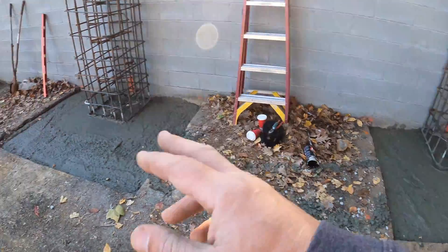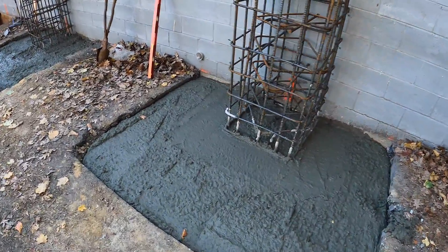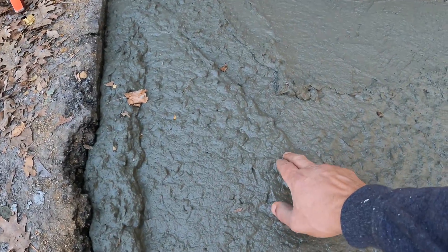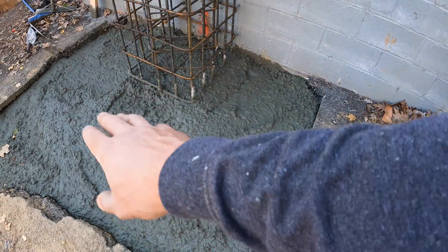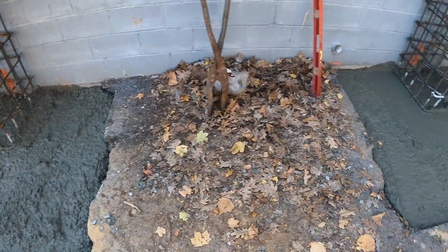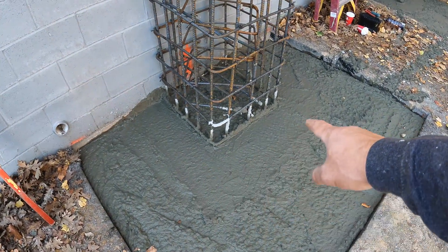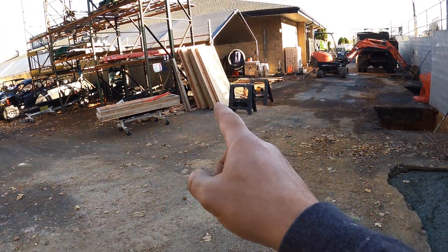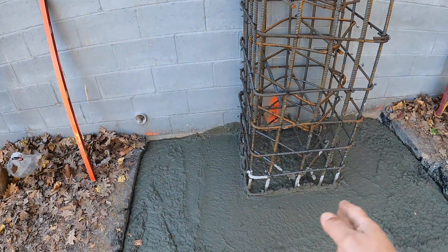This is 10 yards between all three, so each one is like three and a third yards. What I'm getting ready to do — the concrete is getting a little tough. We're going to leave the surface a rough finish so the asphalt will have something to stick to; we don't want that to be smooth. But I am going to trowel out right around the cage — you can see I started doing it already — because Chuck is working on our wood forms over there and I want them to sit on something nice and flat.